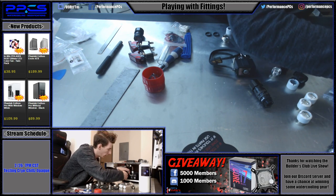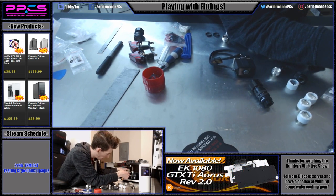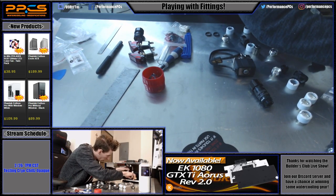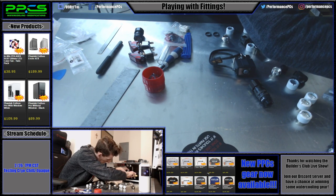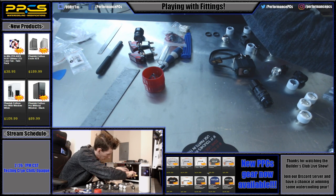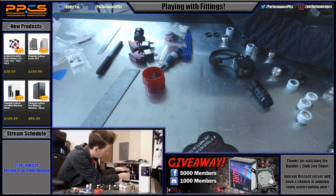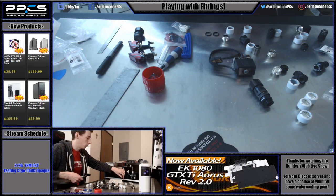I mean, there's always been Mayhem's Aurora, if people aren't too new and they remember Mayhem's Aurora. It's still around. But that has always just been considered a show coolant. So everyone's kind of always known not to use that in a loop for 24/7. Although I have heard of cases where people have run Aurora for actually years. I think those people just put in the extra time to making sure that their loop is clean and suitable for it, I guess you could say.